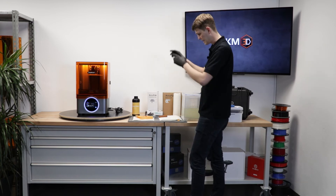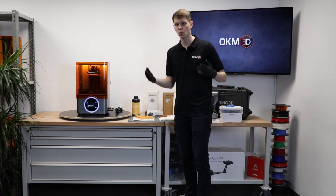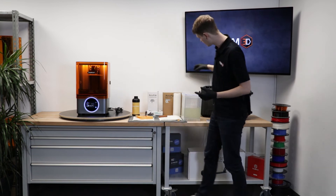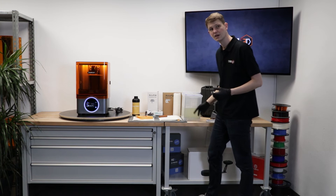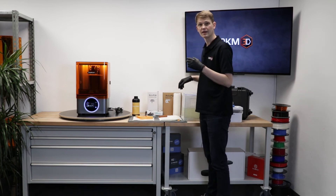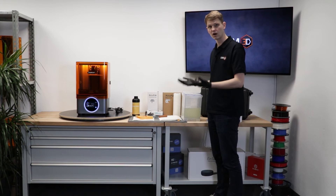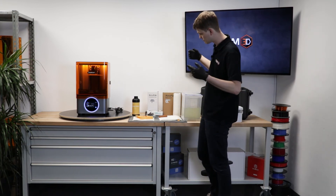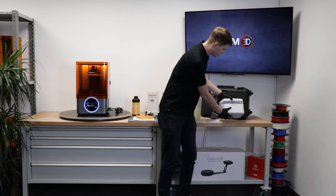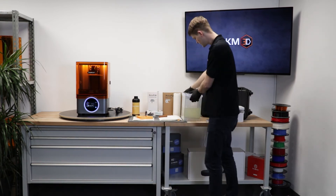That's our part and it looks great. However, there's still a bunch of uncured resin on and around that part. So we're going to need to wash it. Resin is soluble in isopropyl alcohol and you want it as highly concentrated as possible. We've got this little bucket here — you can see it's already been used to clean the cube and a number of other parts, it's already kind of grayish yellow. This is full of isopropyl alcohol. And then there's a washing station that we have from Creality that agitates the alcohol inside as soon as I put a part in and that washes off all the uncured resin. If you don't have something like this, just using a bucket full of isopropyl alcohol, dropping your part in, and stirring the liquid around a bit will do the job. Shining kind of thought that you could use the bottom part of this equipment box, but it's a little small for a part like this. So this right here is what we're going to use.